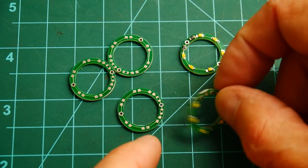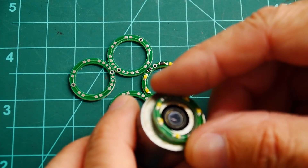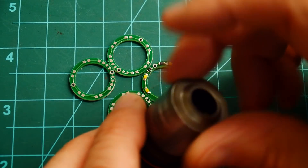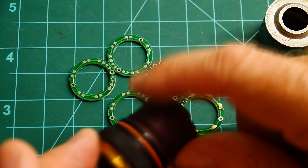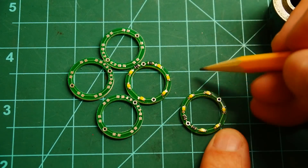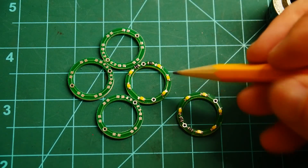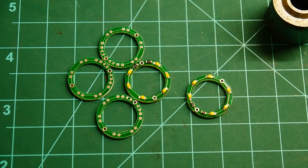I have an objective and a tiny ring light. I can open this up, put the ring light inside, and put it all back together again. I made these so there's a resistor and then three LEDs, then a resistor and three LEDs. You connect with 12 volts — this is a 120 ohm dropping resistor — so 120 ohms and some LEDs, and they turn on.